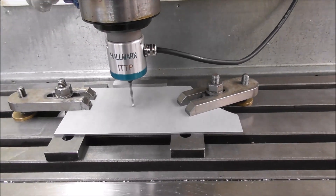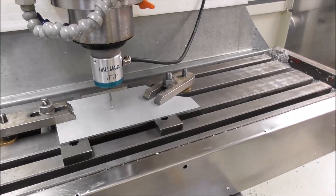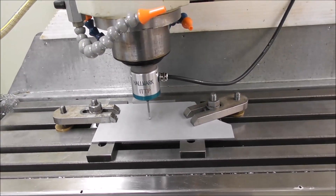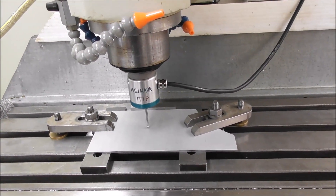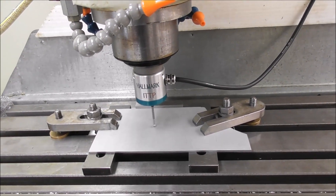This should be okay at three millimeters thick and about a hundred millimeter span. But it's best not to clamp down on soft sacrificial material if you can avoid it — there are disadvantages with doing that: it clogs up the chips and you don't get as good a flushing action.